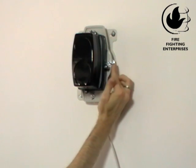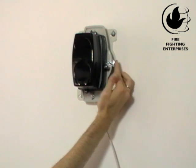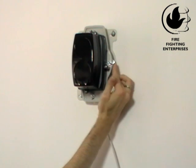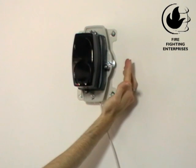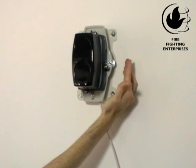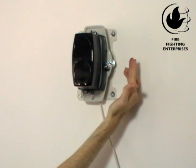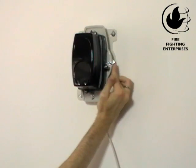While the red LED is flashing, the system is reducing its transmit power. Wait for the red LED to go out. Initially, it can take up to a minute and a half for the LED to go out. The closer you get to the center of the reflector, the sooner the red LED will go out. Turn the thumb wheel half a turn in the same direction. Wait for the red LED to go out. Do it again — it can take up to 20 to 25 turns. Keep chasing the red LED until a turn gives no LED.